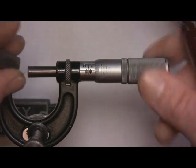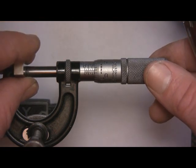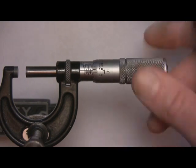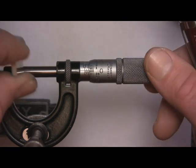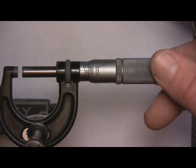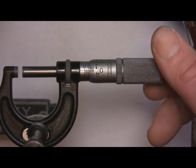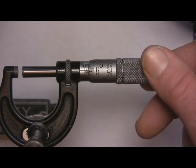Let's check an oddball-sized gauge block — here's a 250-thousandths gauge block. We'll talk about gauge blocks later, but these are perfectly sized to whatever they're supposed to be. This reads two hundred fifty: one, two, three, four, five, six, seven — the next line up would be 275. And for a 125-thousandths block: screw down to 100, then five, ten, fifteen, twenty, twenty-five — that's 125. You read the big number first — one hundred — then add the thimble reading — twenty-five.